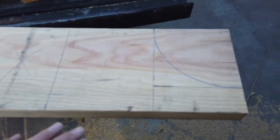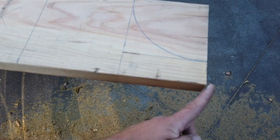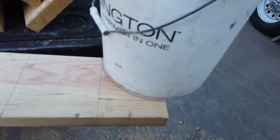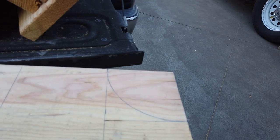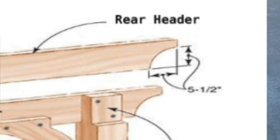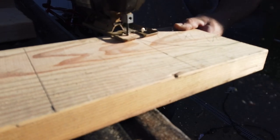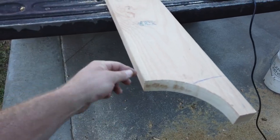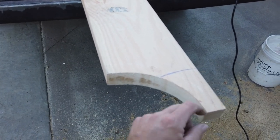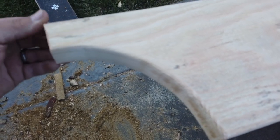This is how I've laid out the top. This is going to be a post and then you'll have 12 inches of an overhang, and then this comes up five and a half, five and a half. I used a five-gallon bucket to mark the radius on it, so all this will be cut out and you'll be left with a nice pergola-looking arch. I'm gonna router it — the plans don't say to, but it's gonna give it a more finished look. Here's what it looks like after it's routered, just gives it a little more finished look.